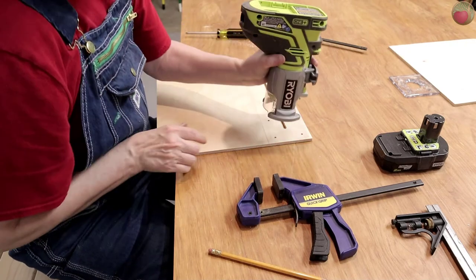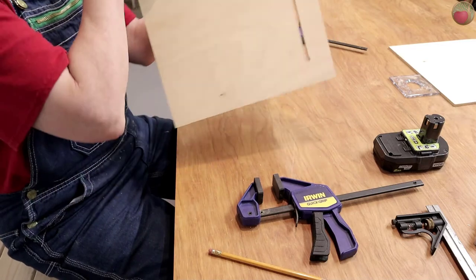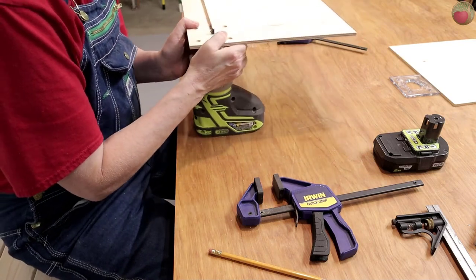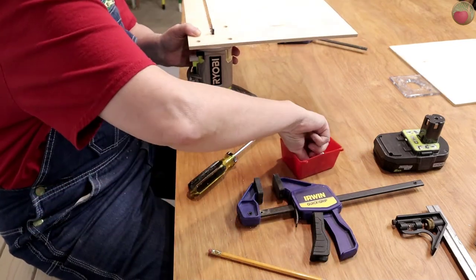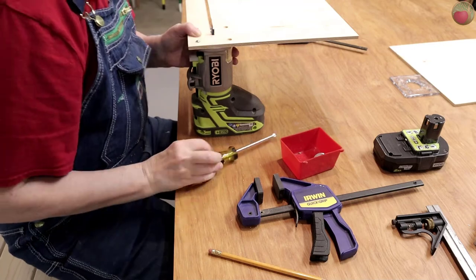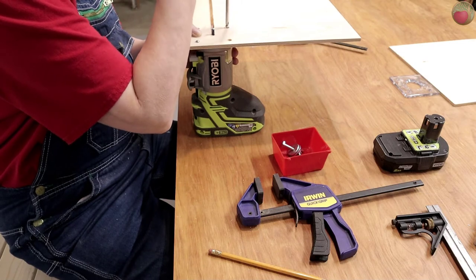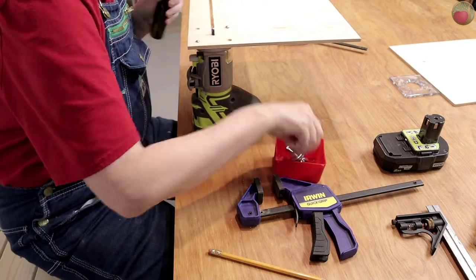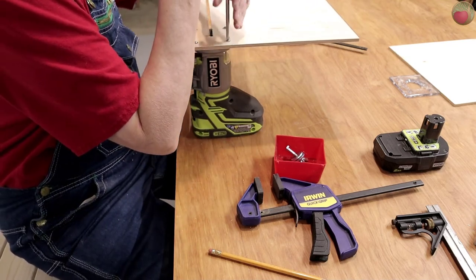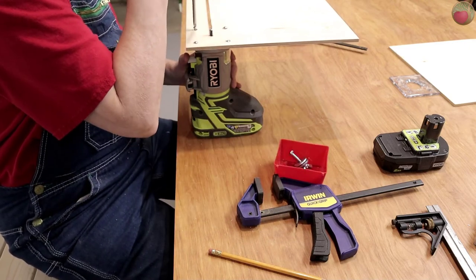Okay, now it's time to mount the router. Be careful of orientation and ensure the front of the router is facing the top of the jig. And then stand your router on end. Line up your screw holes with the router. Now, if any are off, you may be able to simply widen one of the holes a bit by angling a drill bit in it, or maybe use an X-Acto knife to shave a little of the hole on one side. Be sure to get all four screws started before tightening any of them down. And don't over-tighten. There really aren't many plies of wood left at the bottom of that countersink. You don't want to over-tighten the screws and break through. And when you've got them all in, ensure that all four screw heads are below the plane of the wood.